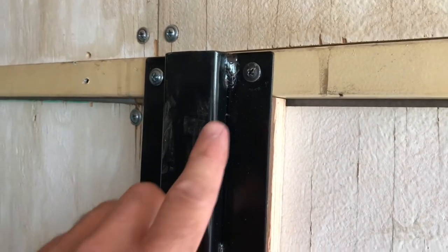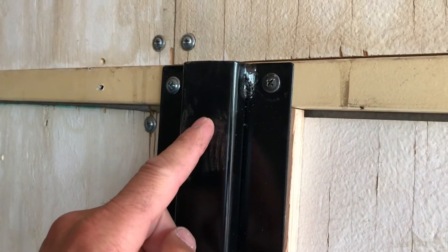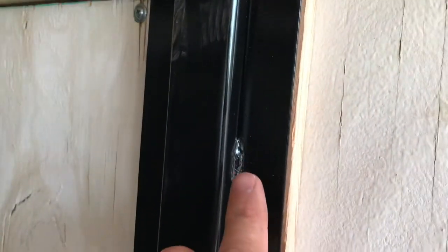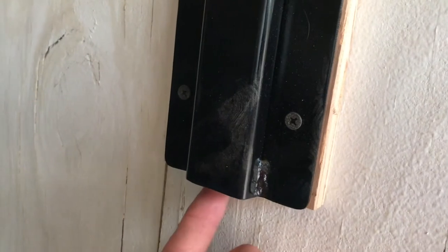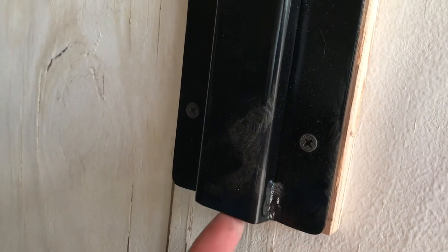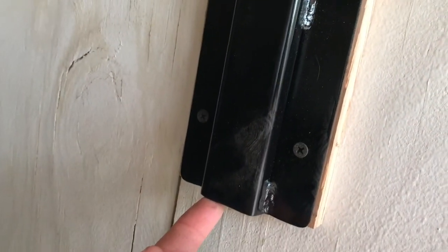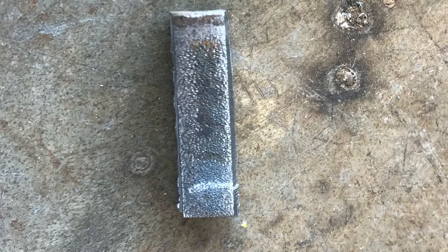I did have to do a little welding to make these brackets. I took that small piece of channel from Home Depot, then got some three and a half inch wide flat bar and tack welded it to the channel. Then I filled the bottom between the channel and the flat bar with small pieces of scrap and welded that all in. The reason I did that is I didn't want the weight being held at the top — I wanted it to bottom out on the flat bar inside the channel and hold the weight that way.